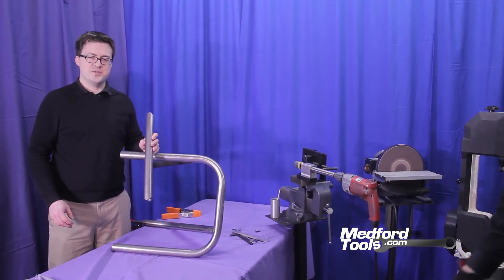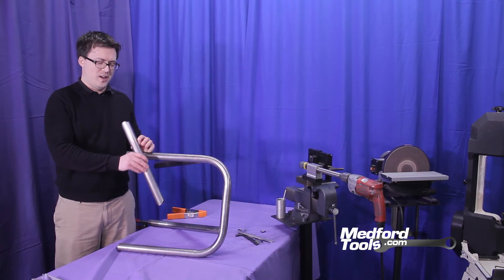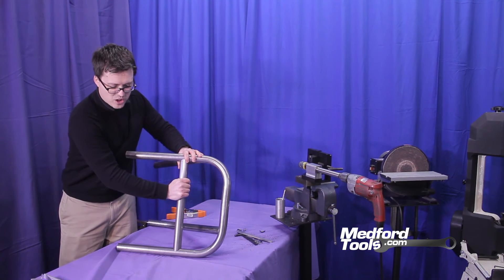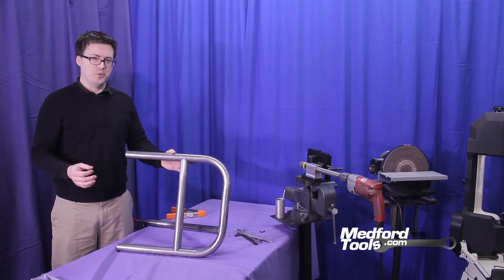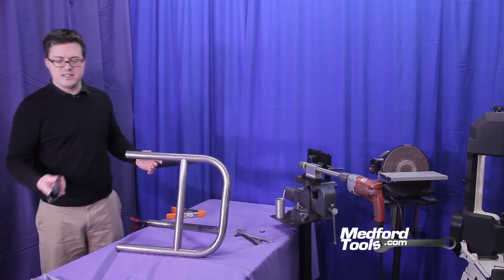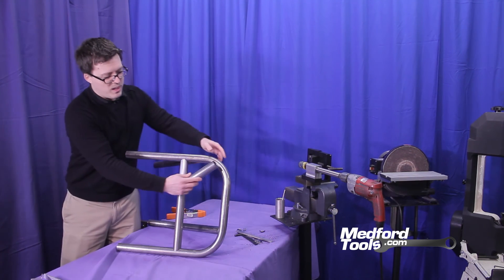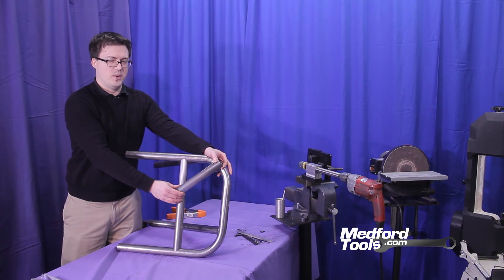Now that Richard has successfully deburred, notched, and cut our tubing to the correct length, you can now orient your tubing and fit it correctly into your workpiece. It is clocked correctly so both notches fit securely and cleanly for a good weld. In the next video we will discuss how to cut a complex double 45 to do a cross brace joint — or a notch that will come from a very odd angle — and how to do it with the same tools, cleanly and quickly.